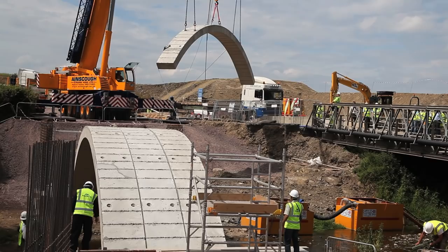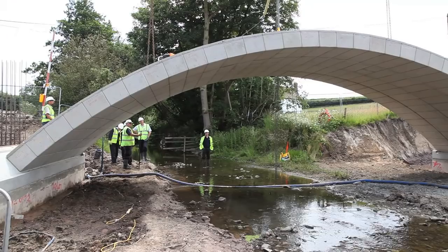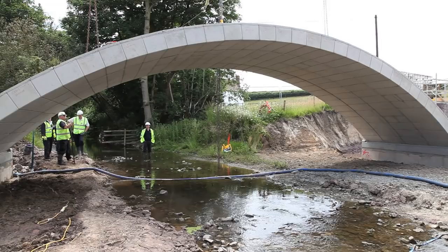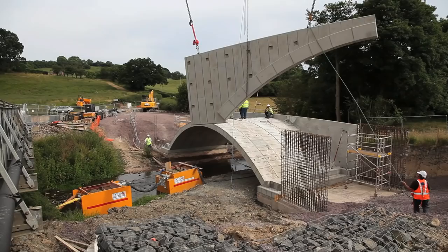These archring units span 13.7 metres, with a rise of 2.7 metres. The cleared width of the finished carriageway between parapets will be 5.8 metres. The load capacity of this bridge is designed for full highways authority loading in accordance with BD37-01. The permitted traffic speed on this B road is 50 miles per hour.